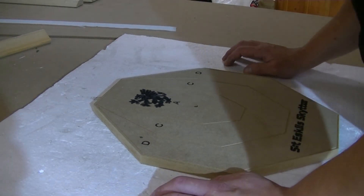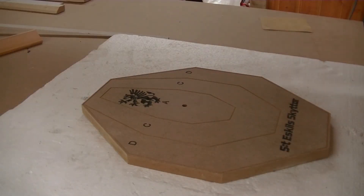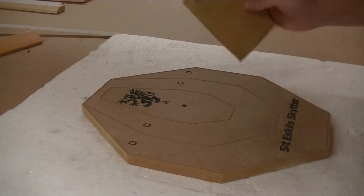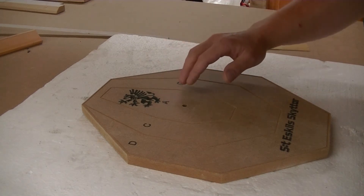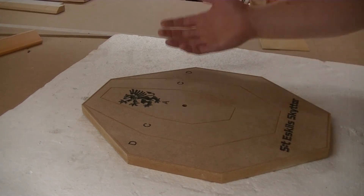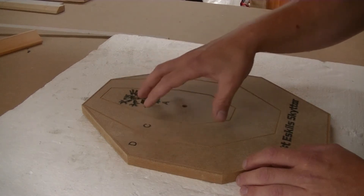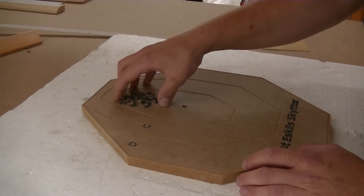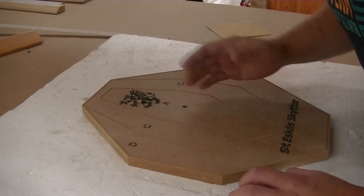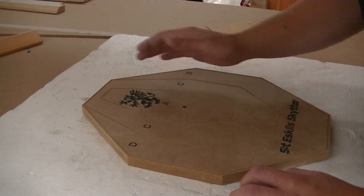Now it's time to let the paint dry, and with a little bit of movie magic that's finished right about now and we're back. It's been a couple of days since we shot that last clip and the paint has dried. I took the opportunity to sand down the excess off camera, and unfortunately there was some slight bleed-through around the fine detail — both around the griffin and around the text. A better way to have done this would have been to put down a layer of clear coat first to seal up the MDF, then paint in all the letters and the griffin, then sand down the excess, because I think that should prevent the bleed-through. But honestly it's not too bad and it's looking quite okay, especially from a distance, so the next step is to put a layer of clear coat on.